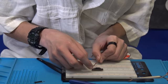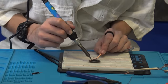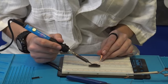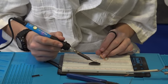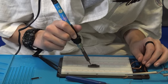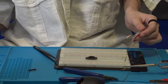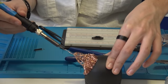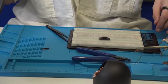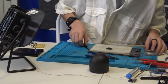My way is you just take it. This is how I learned from someone. You do that. You just take this. And it heats up. And it should absorb enough solder for you to disconnect it. And there you go. And then you should probably not get your sponge stuck. Clean your tip. Now, if you don't have this specific kind of thing, what else works is a metal brush. And because that's technically what it is.